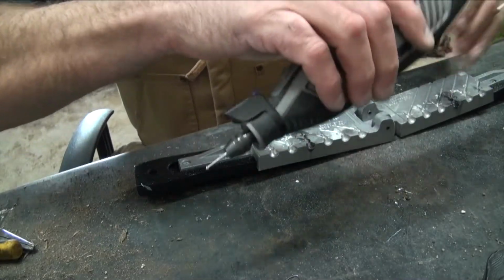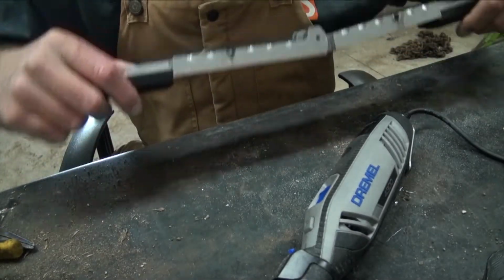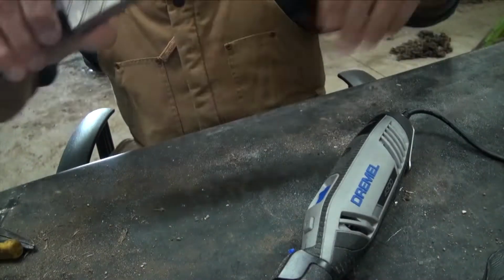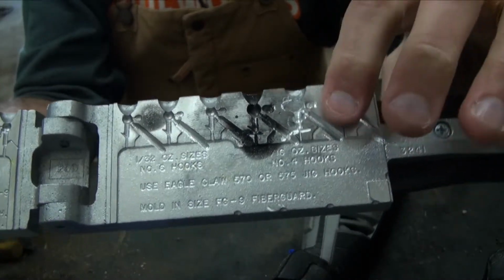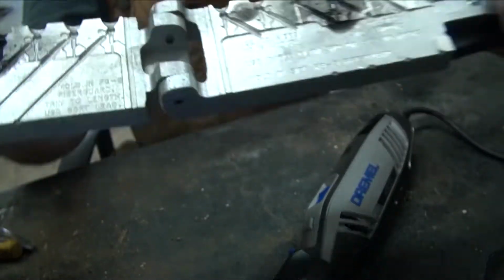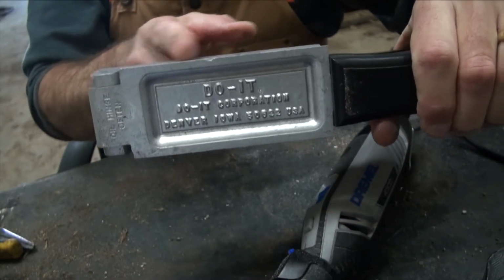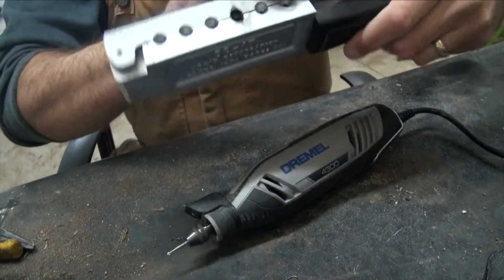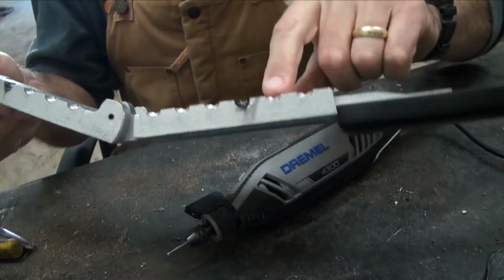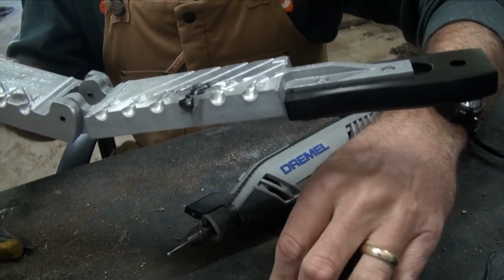All right, I'm gonna call that good enough. We're gonna take that down to where my lead pot is. I'm gonna get the handle on there and smoke it up, and we'll pour a couple heads in there, see how good a job I did in terms of lining up those two cavities. If I didn't, I'll be right back up here to even it up and really look at one pour to see how good a job I did with that, just eyeballing it.